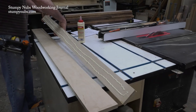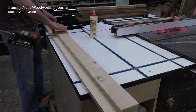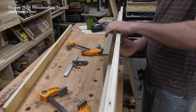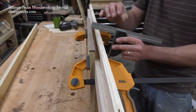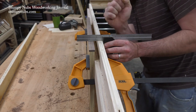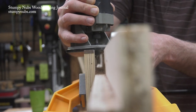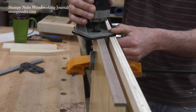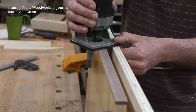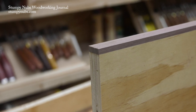For that task, I made a simple jig from a couple of narrow pieces of plywood. This is clamped to the panel so that the high edge of the jig is even with the surface of the edge banding. This provides support for the base of your router to keep it from tipping as you trim the edge banding flush with the surface of the panel. Now as you trim each side of the banding, be sure you're cutting with the grain. This might mean moving the router from left to right on one side and right to left on the other, in what's considered a climb cut. But since you're removing very little material, there's no danger making a climb cut like this.